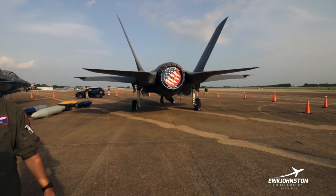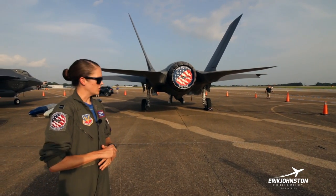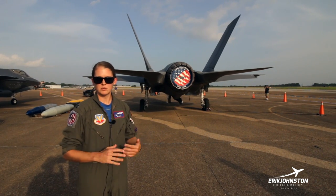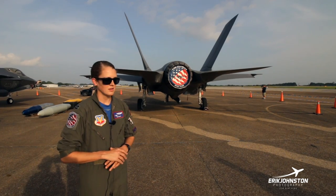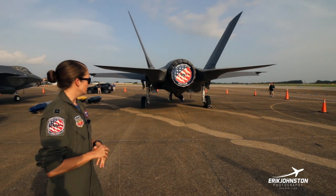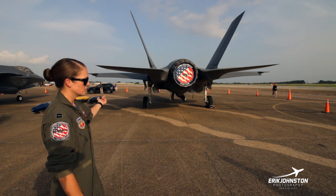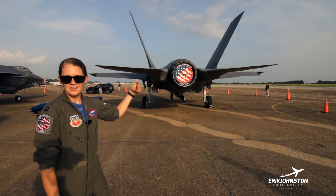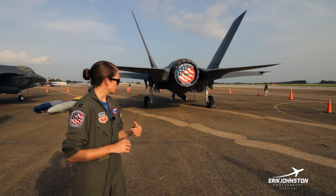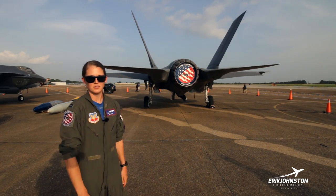This view gives you a shot of exactly how big our engine is — 40,000 pounds of thrust when it's in full afterburner. For the demo, I typically take off at a reduced fuel load of about 44,000 gross weight or less, so we're quickly at that one-to-one thrust-to-weight ratio. When the maintainers take the engine out of the jet, it honestly looks like a gigantic hole — most of the jet is actually that huge engine. Post-flight, we'll have one of our maintainers jump the tubes, put on a onesie, get into the intakes, and inspect the front of all the fan blades for any debris or birds. One of our maintainers can actually stand up fully in that intake, that's how huge that cavity is.